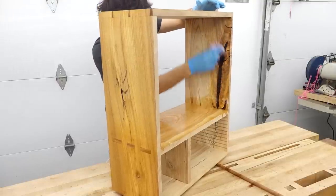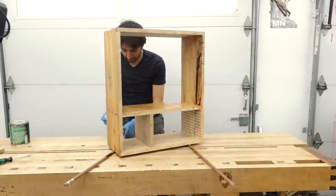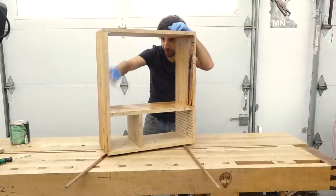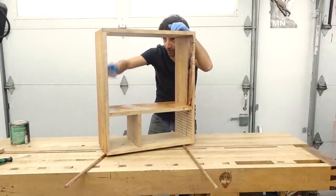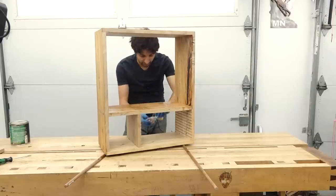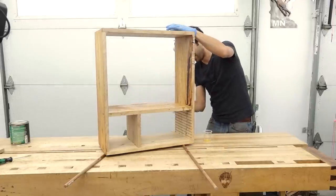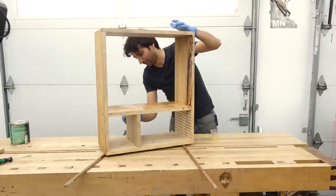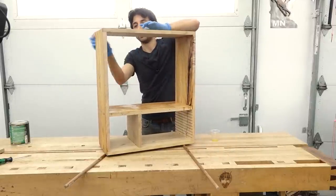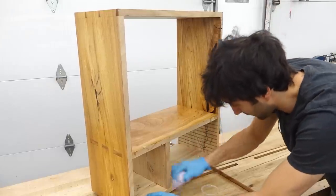One thing I didn't mention this time, which I have mentioned in the past, is that one of the nice things about using epoxy for glue up is, if you're going to use a clear finish like I am here, the epoxy is technically a clear finish. So if you do have any squeeze out or ghosting or hazing from the epoxy going on, when you apply your first coat of finish, it all blends together and you'll never know that there was some squeeze out or some staining from that epoxy. So it's a nice bonus because you can be a little more sloppy and a little more free with your epoxy application because it has no consequence or very little. The only thing I concern myself with is any bigger globs that I would then have to sand or chisel away to get rid of. But otherwise, if I can wipe it away, it's not a concern of mine in the slightest.